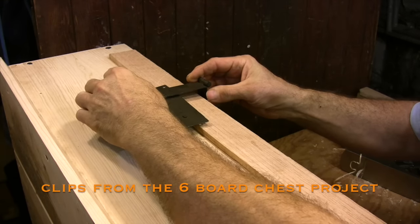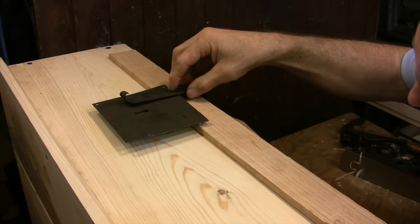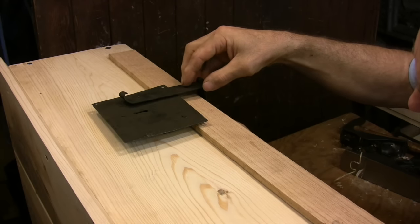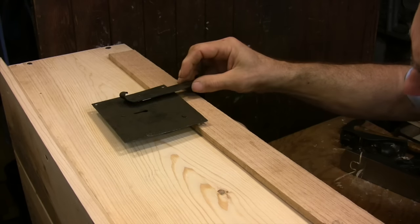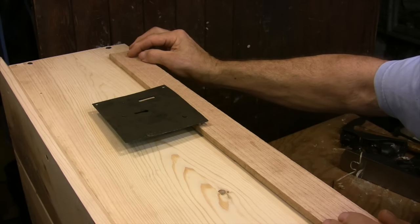This straight edge is going to tell me exactly where the back plate for that mechanism is sitting on the box when I'm done lining it up. I want the center of the keyhole to line up exactly with the center of the front of the box, and the hasp needs to be positioned so that the top edge of the hasp just clears the top of the box but still moves freely in and out of the lock.